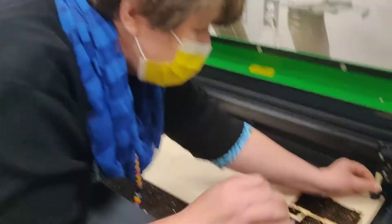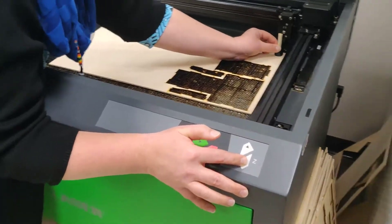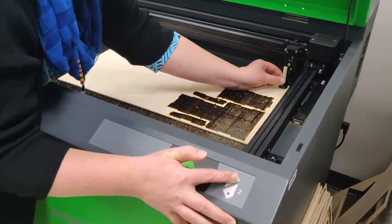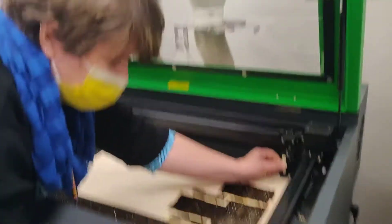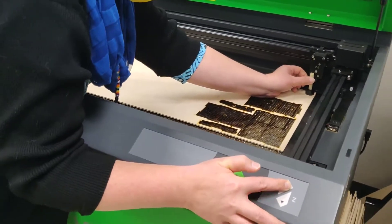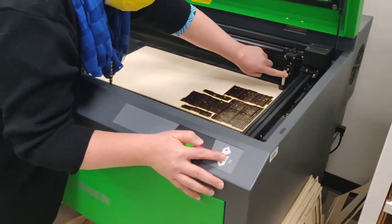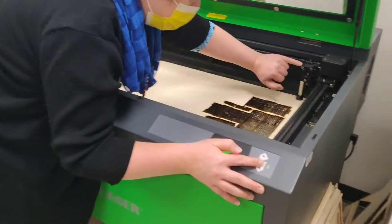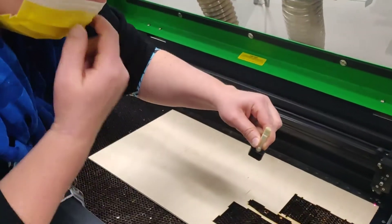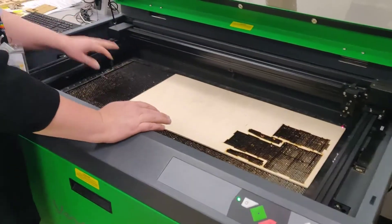Use the tools on the front of the laser — the Z-axis controls — which bring the bed up and down. Hold it for a moment and it'll move a bit faster; then you can push it incrementally. With my other hand I'm feeling for the focus tool to confirm it's snugly in the right position. Right about there is just great — it's nice and snug, not tight and not loose. I can feel that the front of the carriage is flush and the bottom is just resting in there, so it is now focused.